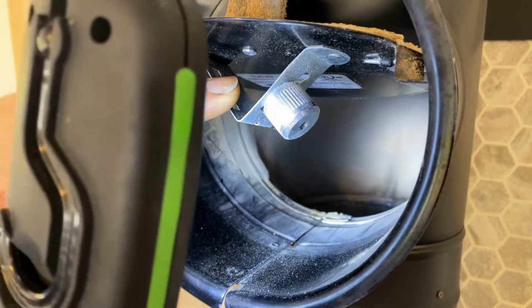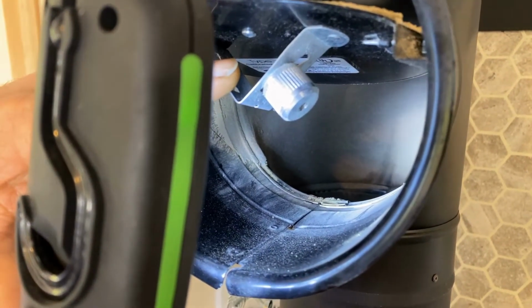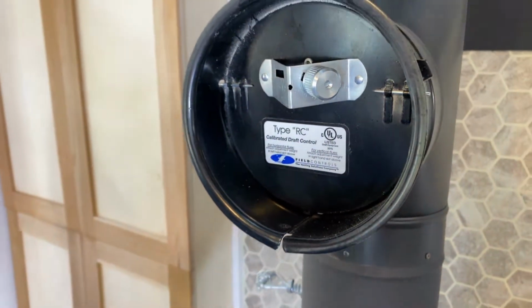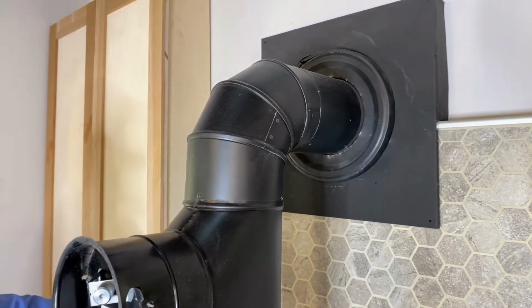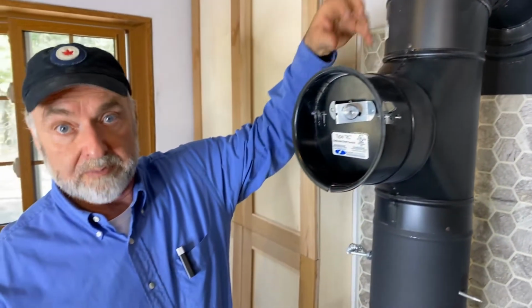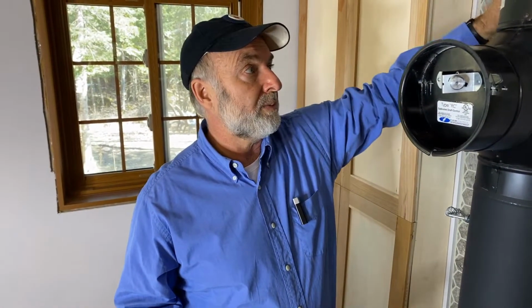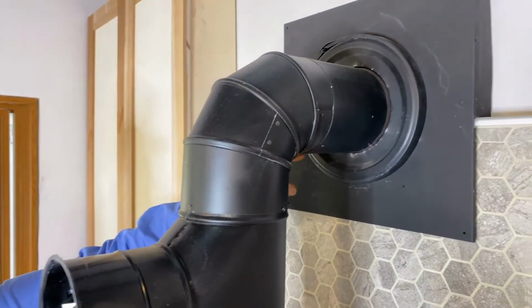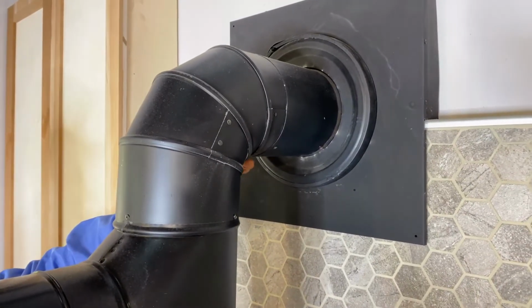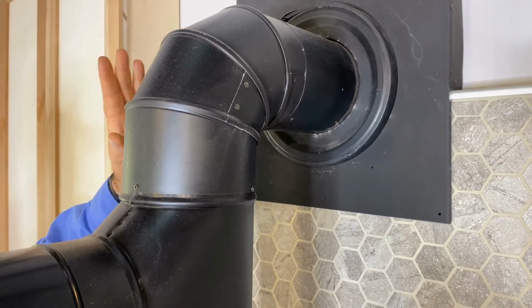And it's been like this for quite a while. It built up to the extent that you see now quite quickly in the process, and it just doesn't get any worse than this. So the only exception might be your horizontal section here, because when you shake down the ash, there's dust, very fine fly ash that rises up because of the draft and goes horizontal, and in this case it then goes vertical again and up out of the chimney. Well, when that fly ash is traveling in the horizontal direction, some of it can settle out. So it's possible that you might have, after several years maybe, 1 inch or 2 of fly ash on the bottom of a horizontal section like this, which could reduce your draft somewhat.